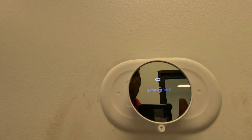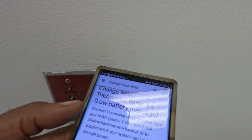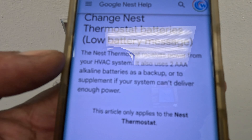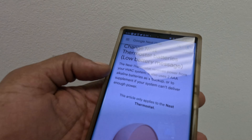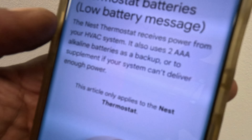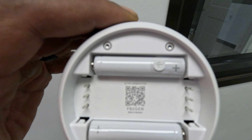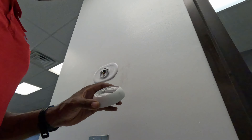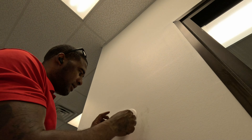All right, so it says low battery — that's the M19 code, which is low batteries. I either need to change the triple-A batteries or I should have 24 volts to it; I'll give it a minute to charge up. We're going to need two triple-A batteries. You have to remove the film from it and it'll work. There we go.